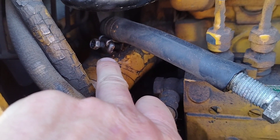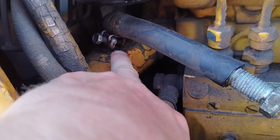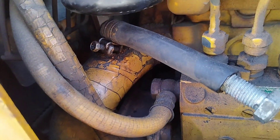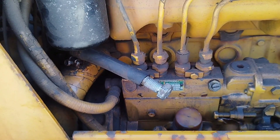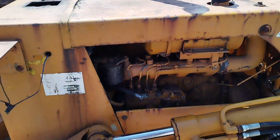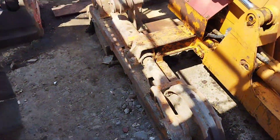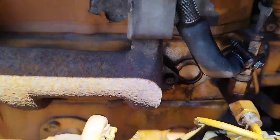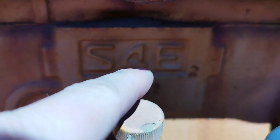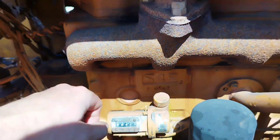Under here I don't want to mess with this too much, because it's joined onto the main top hose on the engine. So if I've got a crack in there by pulling on it too hard, that would be a bit of an issue. So I've left that just capped off and put a jubilee clip around that - for the moment, call it good. Done the same on the other side - cut the pipe down, put a bolt in it, it's out of the way. This is an S4E2 Mitsubishi engine, and I found a website that does little parts and everything for it - so that's good.